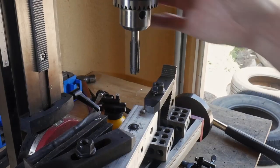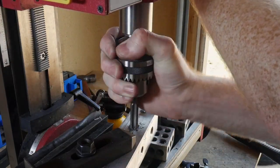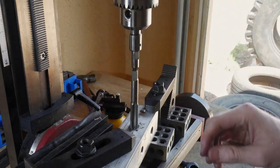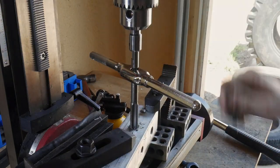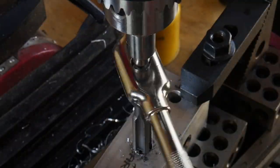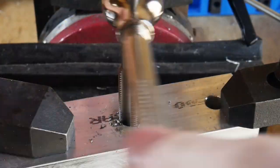The first step is to drill a hole into your tooling arm. My belt grinder accepts inch-and-a-half by inch-and-a-half aluminum tooling arms. You can start with just a chunk of bar and drill this hole, but in my case I had a tooling arm with some existing holes that I'm repurposing, which made drilling easier. The wheel I ordered has bearings that accept a 12.7 millimeter, or half-inch, axle, so I'll be tapping this hole to a quarter-20.